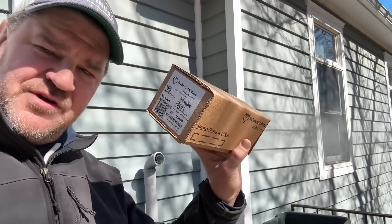We also have a brand new RB24 here in my hand. I'm going to go swap that out. Now that I know the system is running and nothing else is wrong, I can proceed with giving the customer a diagnosis and getting the job done while we're on site in one trip, saving the customer time and money. Parts are on the truck.